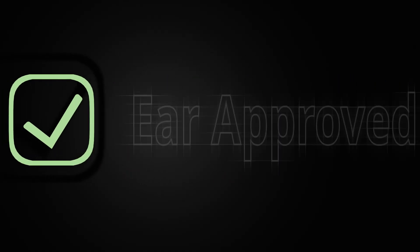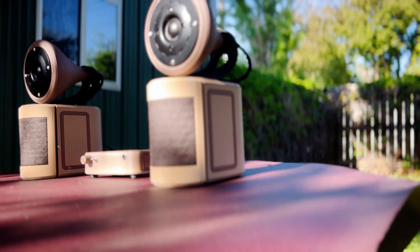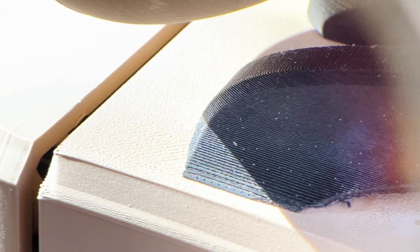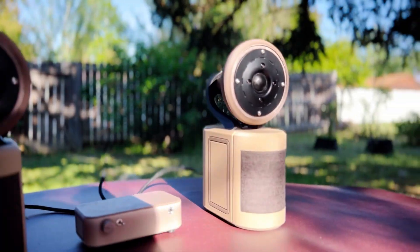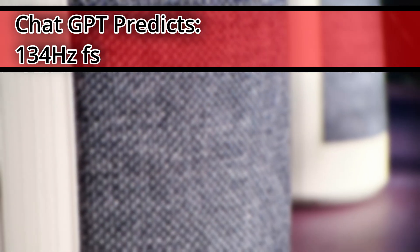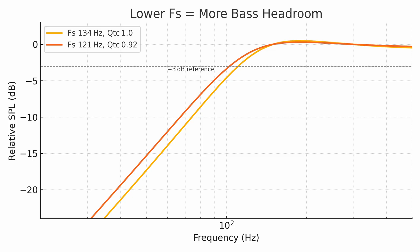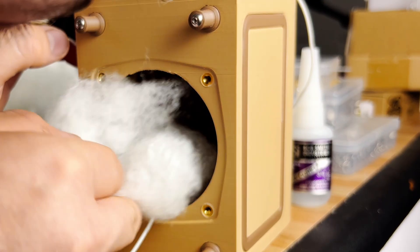So that was better. My ears are pretty happy, but we have access to scientific equipment, so the numbers will be the real judge of these AI-designed speakers. I'll put longer playtests at the end of the video. The chatbot predicts a resonant frequency of 134Hz, so let's hook up the DATS box and see. Moment of truth — the FS is 121Hz, which is 13 lower than predicted, but this is good. Lower FS means more headroom for bass. The polyfill likely made the box act a little bigger than it already was.